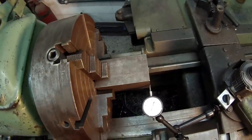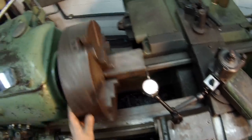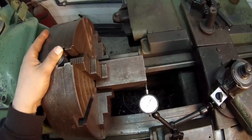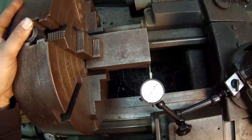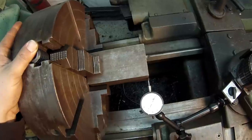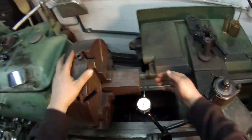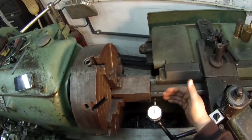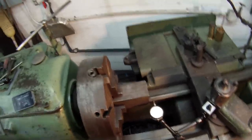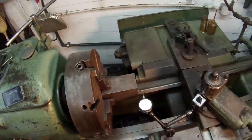That's minus 3. It's nearly 5 — so we're off about two thousandths right there. I'm setting a zero so it's a little easier to see. I'm rocking it at zero, rotating 180, coming back in — looking for the lowest point — and it's actually maybe a thousandth and a half. So we've got these two sides pretty well centered — a thousandth to two thousandths off. Now we've got to work on the other two sides. I'm going to take the camera back off the head strap and put it on a mount so it's a little more stable.